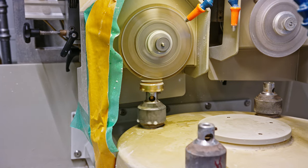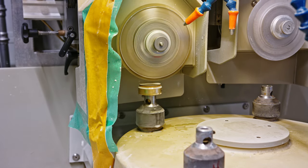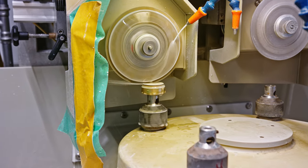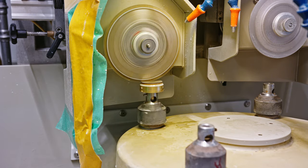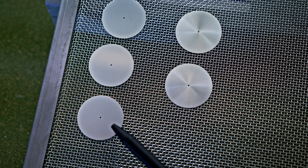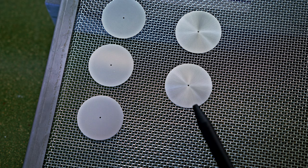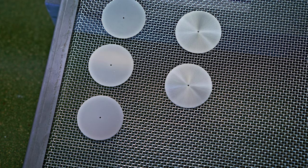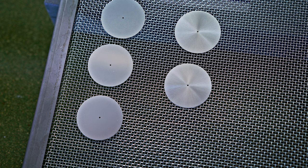This is how the sun ray finish of a dial is done. The basic dial plate gets a sun ray finish, done for one purpose only: to reflect the light in the way the designer wants when it hits the dial. You see here a brass dial — due to the galvanic treatment it has changed color to gray. Here is before the sun ray finish, and this is after. Every step you see is done solely to reflect the light in the appropriate way. Once the sun ray finish is applied, you get those effects in light, and later on it will be lacquered and the lacquer polished.